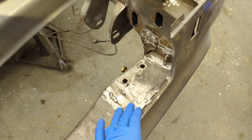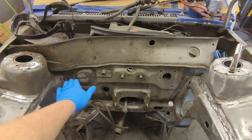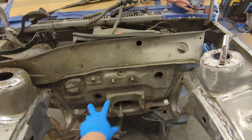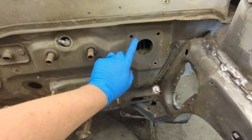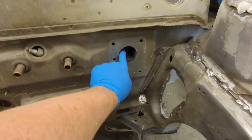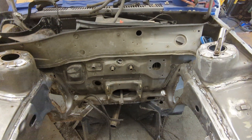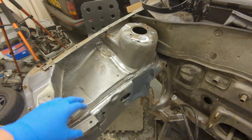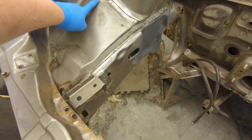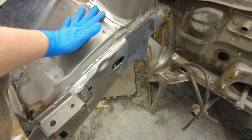Right guys, as you can see I've welded that and cleaned it back. It's all dressed, and we've also stripped the base — I've taken the servo off and taken the steering rack off. The steering rack is held on with four M8 nuts as is the servo. There's a little clip that goes in the brake bar and the UJ that goes inside, so it's really straightforward to get out and gives me a lot more room. I've also dressed this side back — obviously this bit needs cutting out, however I can still do most of the stitch welding on this side.